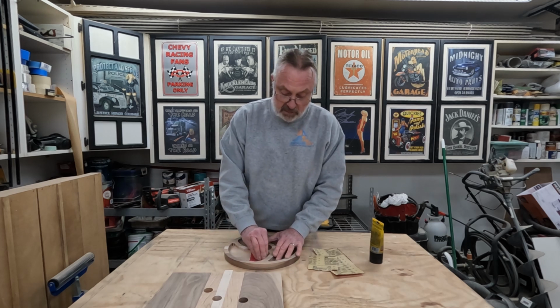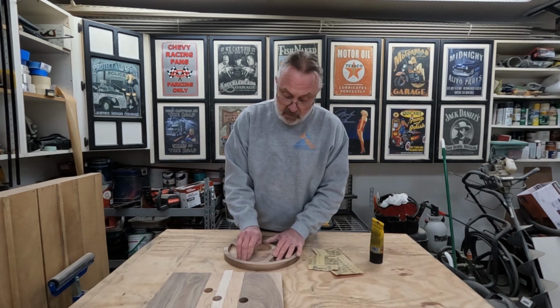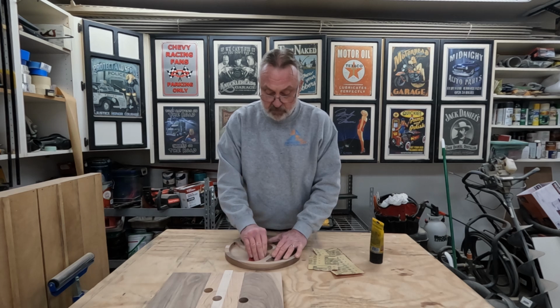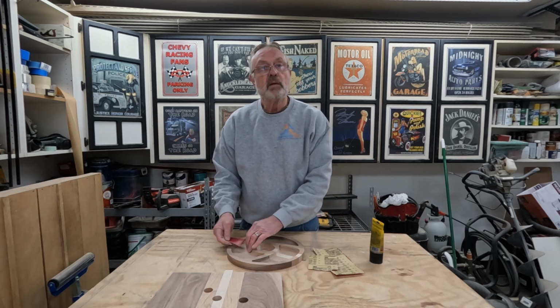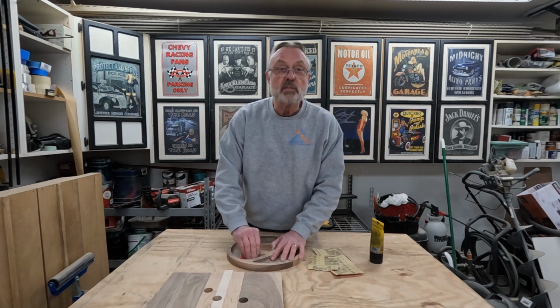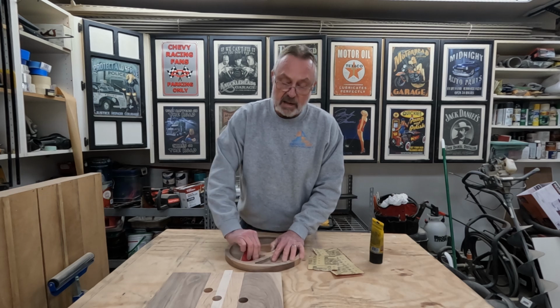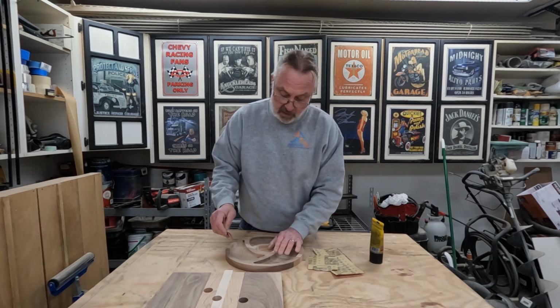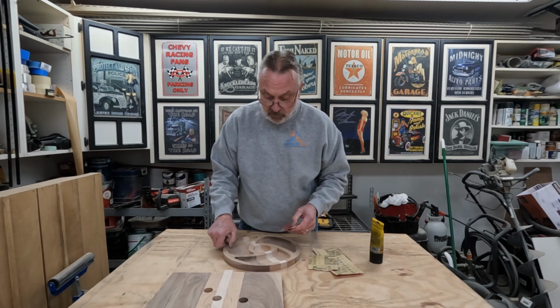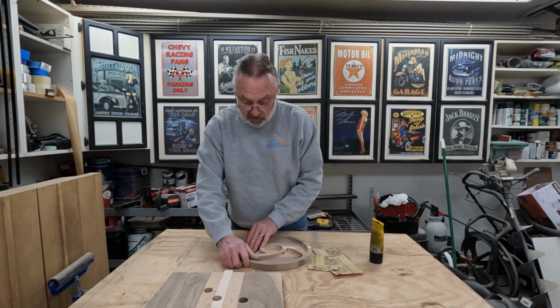So I don't know exactly why this did it, other than the wood was only here for maybe 2 days from the mill before I planed it and started this project. Then maybe I should have given the wood more time to acclimate to my shop, or maybe after the glue up, if I would have given it a little more time, I'm not sure.